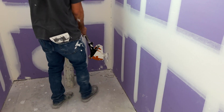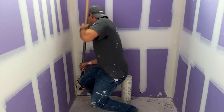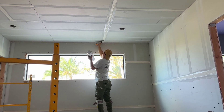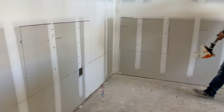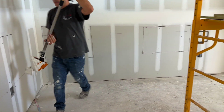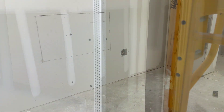This corner tool helps apply an even coat of joint compound on inside corners. Work continues in this room, but a problem is discovered — the electricians didn't install the required outlets and the wires were drywalled over. To fix this, patches of drywall were cut out to locate and terminate wires for the outlets per the plan. These cutouts can be easily taped over now, but would be a big problem if not caught in time.